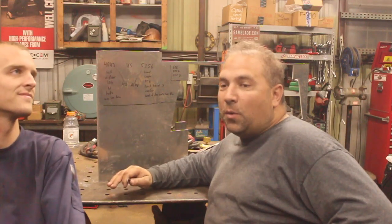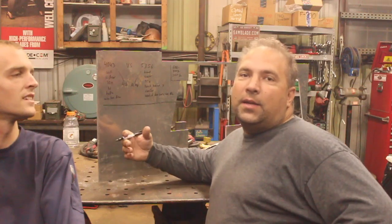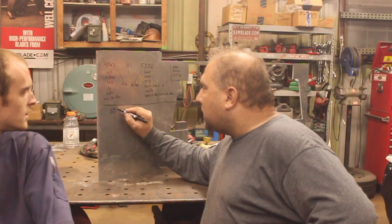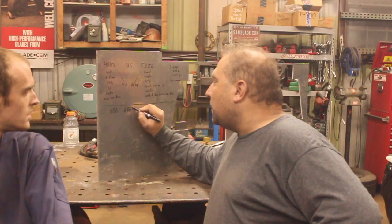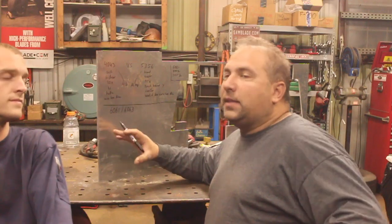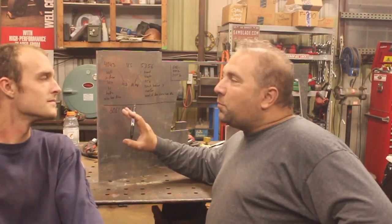Now, of course, if you've been in the business long enough, you can call the manufacturer. Sometimes they tell you what it's made out of, sometimes they don't. Typically, a lot of plate and angle and tubing, rectangular tubing, that is used in trailer manufacturing is either a 6061 or a 6063 alloy. I've talked to trailer manufacturers and this is what they were using. That doesn't mean every aluminum trailer is made out of those, but it would be a pretty close guess.